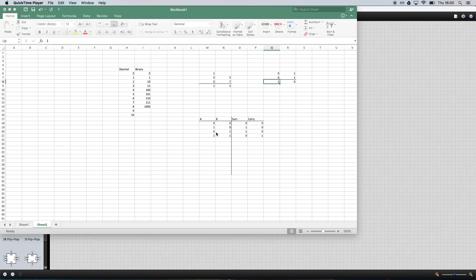Now we're going to take the ideas we just talked about with our half adder and apply them to creating a full adder. Then we're going to do some ripple math, which will demonstrate how with just a couple of simple logic gates you can do full addition. This is in fact how your computer does full addition in its processor.